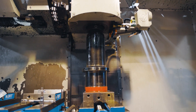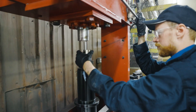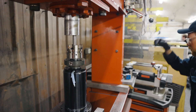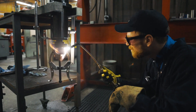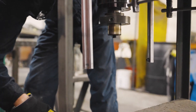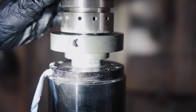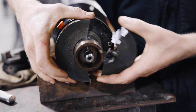After that, the spindle was free. To remove the drawbar and the drawbar ring, I put the spindle in an H-frame press and depressed the drawbar and tried to pull out the drawbar bolts. After I found the broken drawbar bolts, I removed the spindle coupling. To remove the spindle coupling, you're going to need a large rosebud torch. The one I used in this video wasn't great, but it did work. Apply heat to the end of the coupling while hanging the spindle upside down, then use a puller and pull the coupling off of the spindle shaft. If your drawbar bolts are broken inside of the drawbar ring and still in the drawbar, you're going to need to remove the drawbar ring from the spindle. You can grind it off with a cutting wheel, or it's just as easy to put it in a knee mill, saw it almost down to the bottom, and then just use a hammer and break it free.